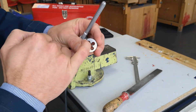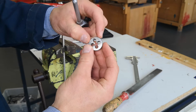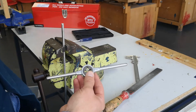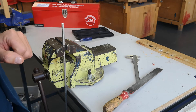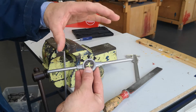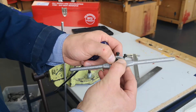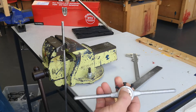The die has a split in it by design so it can expand or contract depending on which screw you use. Because we're doing the first pass — just as with a tap, you need to do at least three passes — we want the die at its widest possible opening. Position that slit at the top of the die just underneath the central screw, then bring that central screw down to open the gap.